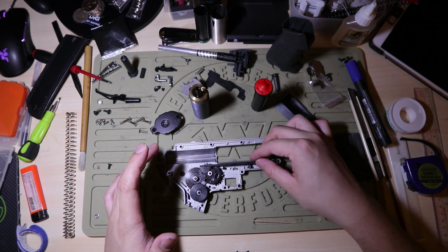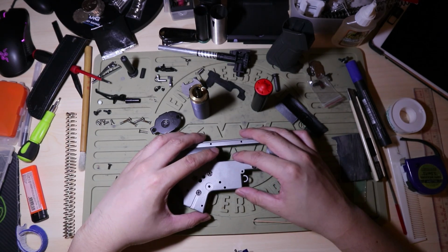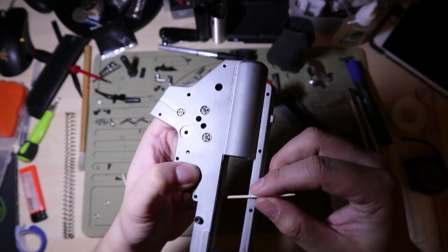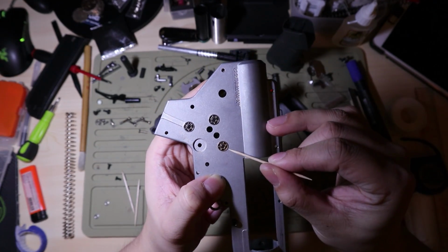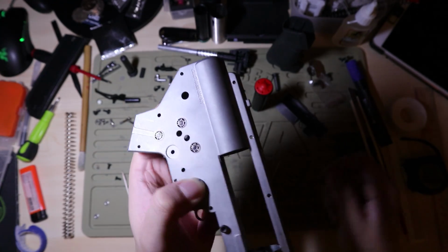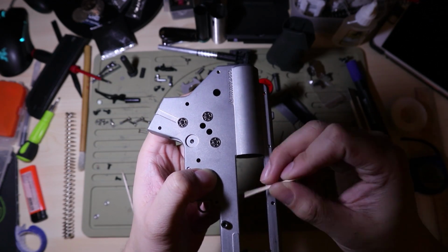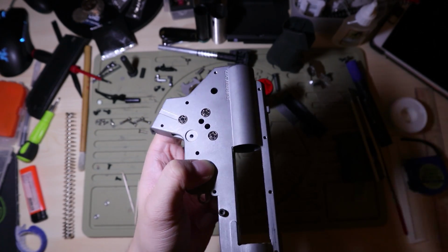So I put the tappet plate in. And basically, when you move your tappet plate, it should move freely. Right? It should move freely. Notice the sector gear is not turning. If the sector gear turns, it will do this. Right? It will move the bearing. Right, so I'm moving it, and it's not affecting the sector gear. Right? So that should be fine.